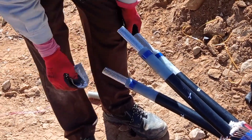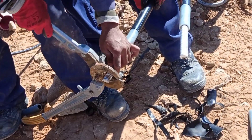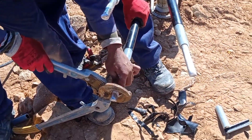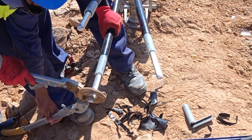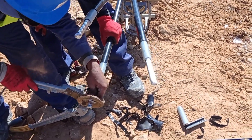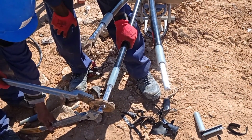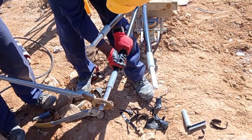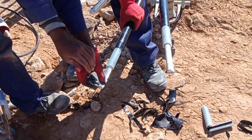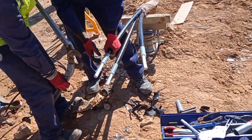This is the gel which we are applying on the cable for putting on the insulation. Now we are going to cut this cable to the required length. We need to make sure the required cable length is enough — if the cable conductor is longer than the connector, we need to cut it to make it the same length as the aluminium connector.